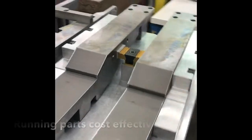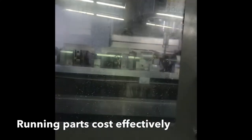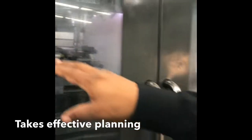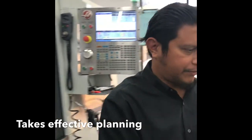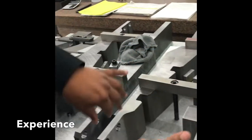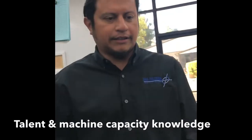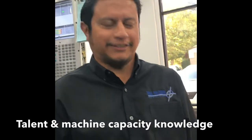To save on cycle time, we wanted to load off the machine. We have one pallet with eight parts loaded, four operations — two per position. The parts rotate: they machine the tops, roll the parts over, machine the holes, roll again, machine the other holes. Who came up with that idea? Todd, the owner of the company. It makes it way more cost-effective — you're loading, unloading, and tightening parts while the machine's running.